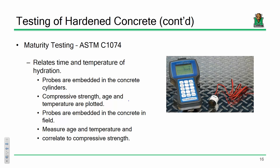It's very similar to what's done for bridge inspections in general. For instance, if you've got a bridge that's in service and it's undergoing its regular two-year inspection interval, and you start to notice, let's move away from concrete just to give you an idea, some movement on the abutment wall, or some inclination, like the abutment wall starting to go like this. You might say, okay, we're going to have to start placing some real-time monitoring.